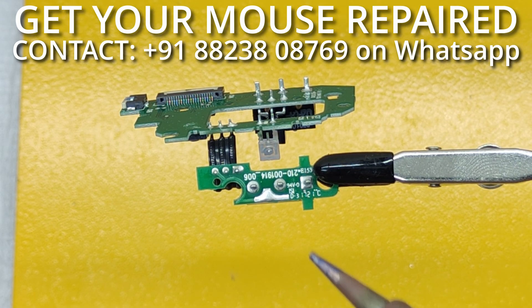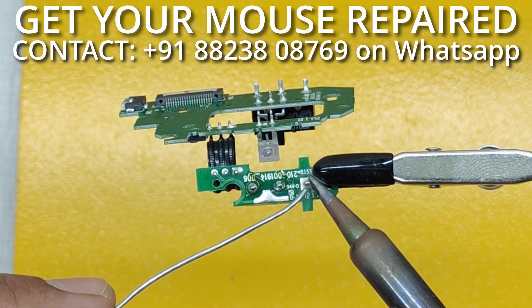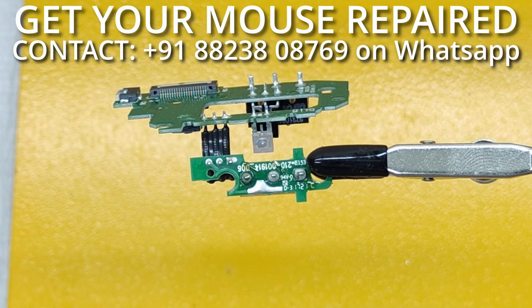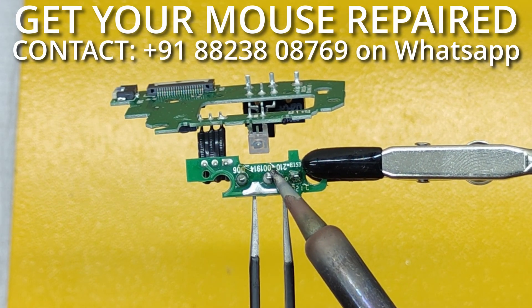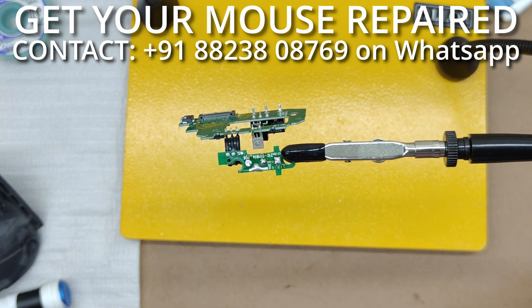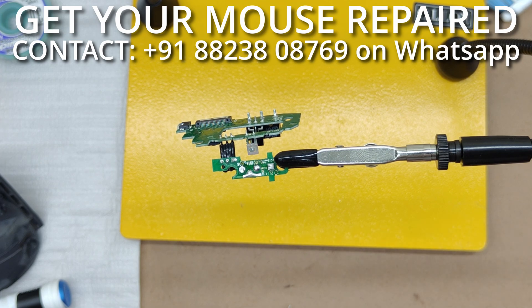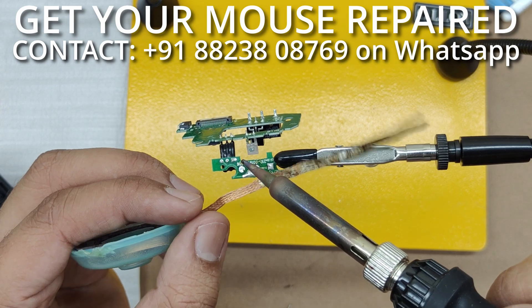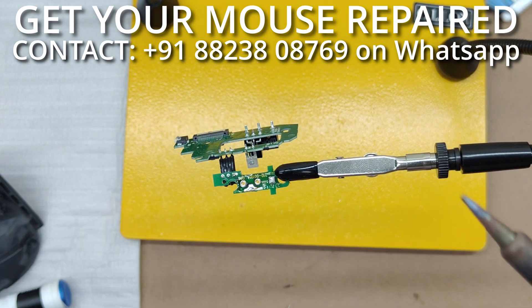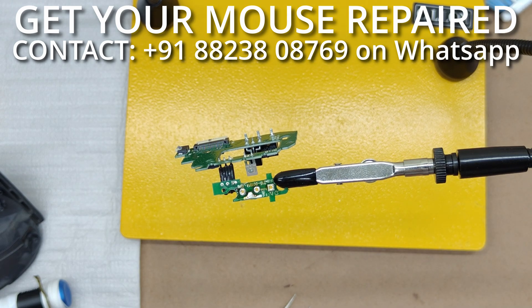I will be adding some fresh solder to these joints so that they are a little easy to melt. Now I am going to pull the switch from the other direction and heat up all three joints at the same time — that is how you remove the switches. I am also going to suck the remaining solder. It's very difficult because this is a really small PCB, so I should be using some solder wick. We were able to remove the switches and I was able to clear the holes for the new switch.